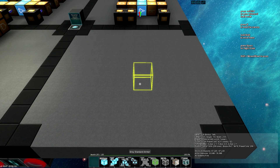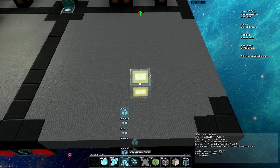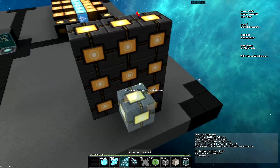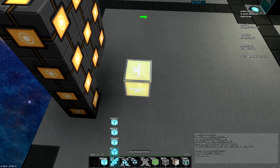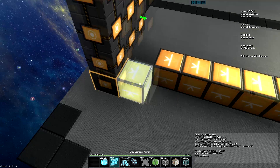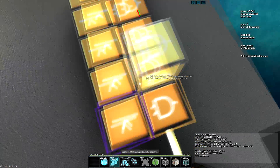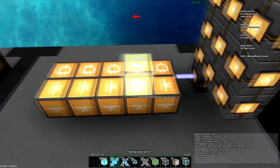Next up, I'll show you how to build the combination lock by compacting this shift register and adding a couple extra components. To start off, I'll want to build my control panel — something simple with one through nine and the reset. Then I want to build the shift register by putting down a flip-flop for every link in the chain for a five-digit combination lock. Then set up the reset switch by selecting the reset button, putting down our ANDs, selecting each of the flip-flops and connecting them to the ANDs, and then the ANDs back into the flip-flops. It's a little monotonous, but if you want multiple links in the chain, that's what you've got to do.